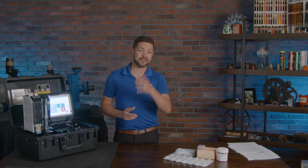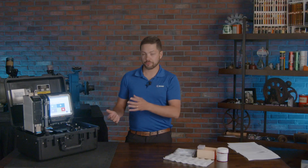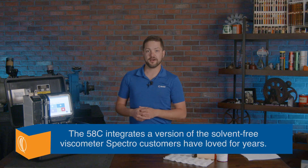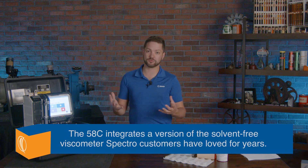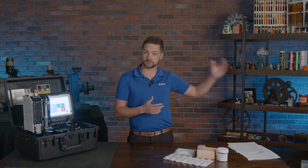Kinematic viscosity is the most important physical property of the lubricant. Here's a case example: someone was using this and determined on a new engine that was installed that the viscosity, which should have been about 120 centistokes, was actually 70 centistokes — a considerable difference in the protection that oil needs to provide. They were able to detect the viscosity change, and through further testing on this instrument, they detected that diesel fuel had gotten into the engine oil. They investigated the source and corrected the issue — a case where getting data fast prevented a potentially catastrophic outcome.